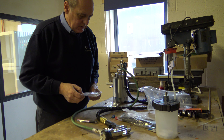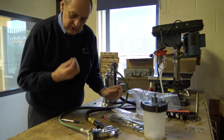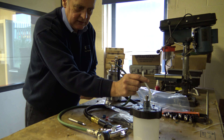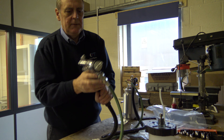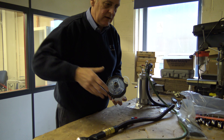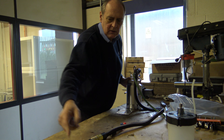Included in the kit you get a couple of these little grommets. Also with that part — the Sprayman UK 005, which is that fitting — you also get a couple of grommets, and that literally just connects over there. So the air that would normally come out of the gun and go into the Flexliner to pressurise the Flexliner via the little tube is now blocked off. Use a couple of cable ties to tie those together. Nothing really changes in operation — what you have with your normal cup or a Flexliner cup is air coming into the pot, pressurising the pot, sending the paint out. This is identical: you're doing exactly the same thing, except you're pressurising this bigger cup, the paint still goes up to the gun and out.